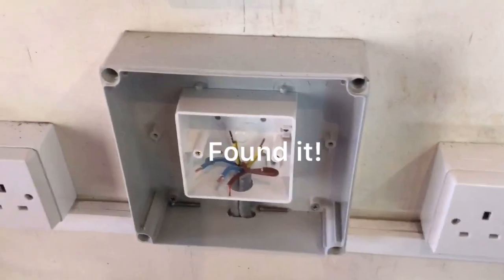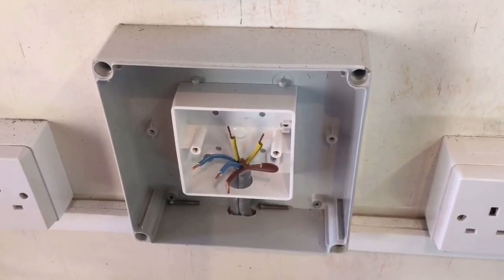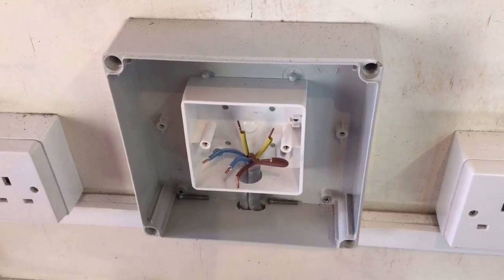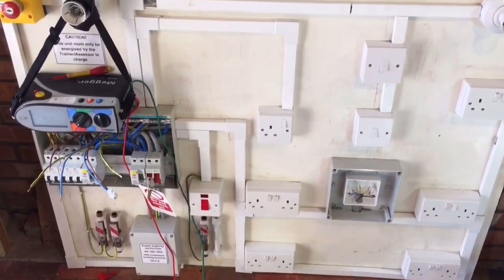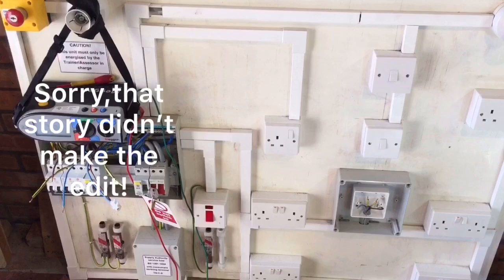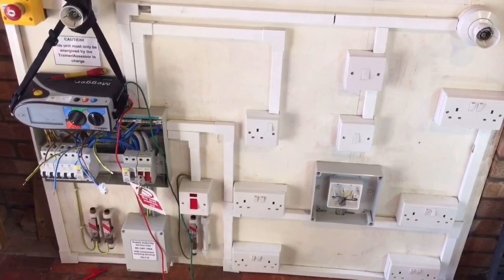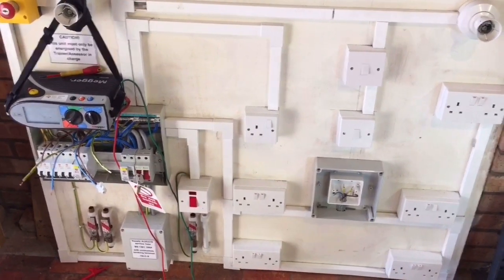So we've identified a break between the last socket and the next-to-last socket — and there it is. Normally what sits on there is a little accessory rack for putting faults on, but that's the break. In reality, a missed-out socket or a cut cable will give you an issue like that. Not something you'll experience all the time — I've had it once in a 40-year career. Sparky Pete signing off — constructive criticism much appreciated, because nobody knows everything and there's always more to say.